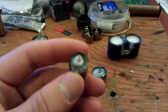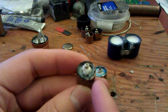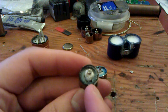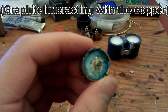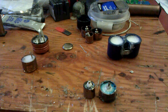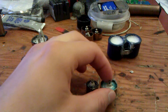So these cells here — they're copper cathode and magnesium anode, but I also have a piece of nickel chromium and I coated the whole copper pipe with graphite paint. So it's got three different cathodes: nickel chromium, graphite, and copper. One interesting thing is they turn blue instead of green, and I'm certain that's because of the copper. This one's got a fair bit of corrosion, but they're both at 1.5 volts instead of 1.8, which would be the max you could get with graphite and magnesium as per the galvanic scale. But they're just interesting — it's a pure longevity test.